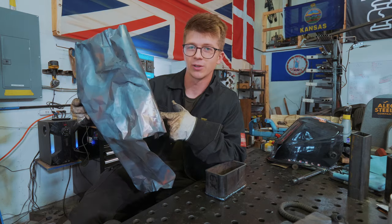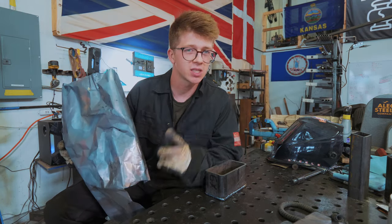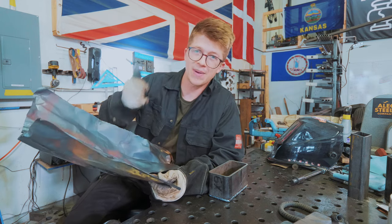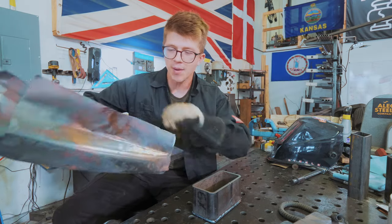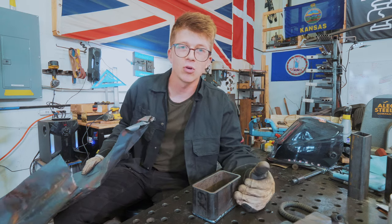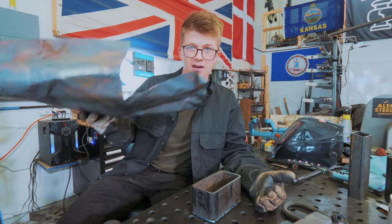So this stainless steel that we've oxidized, this is a trick that I believe I learned from Will, who I believe learned from Steve Schwarzer. This oxidized stainless steel won't stick to our powder or our hammer plugs, but without it, this box would. It's also very hot out. So we're gonna line the box with this so that this can come off without needing to be ground or milled away from the billet. It can just be peeled off because it won't be stuck.